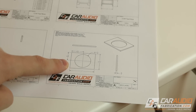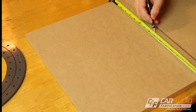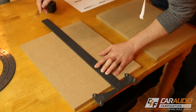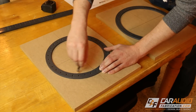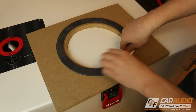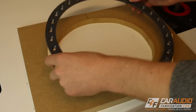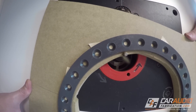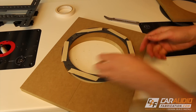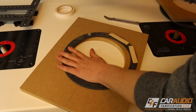I now have a nice stack of wood ready for detail work. First I want to cut out both the hole for the subwoofer and for the flush mount. For this I'm using circle templates from my show sponsor Mobile Solutions. I'm using a double baffle — basically two layers of thickness of wood — for extra strength and to flush the subwoofer down into the surface. After carefully measuring the location, I rough cut the wood with a jigsaw. I then apply double-sided template tape to a circle template, stick it to the work piece, and over at the router table use a flush trim bit to copy the template shape. The advantage is a perfectly precise, perfectly round cut, which is important for making sure the subwoofer seals correctly within the box.